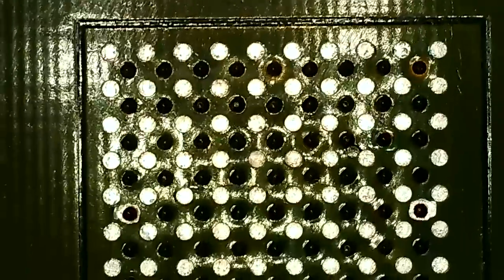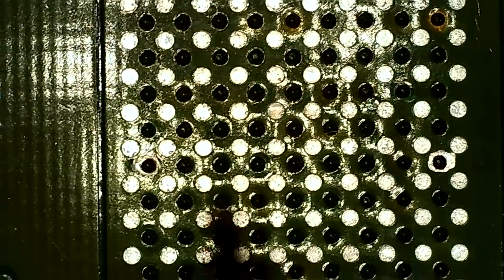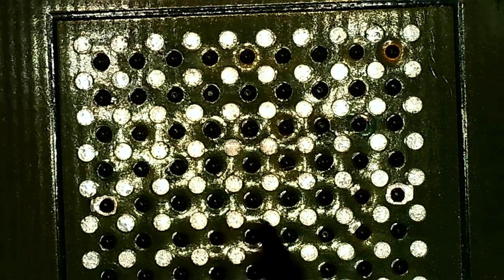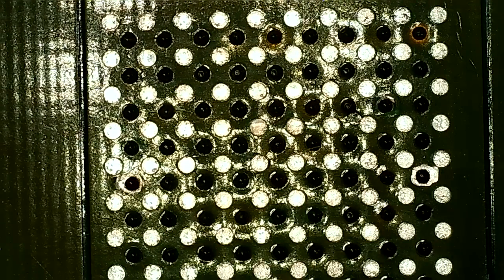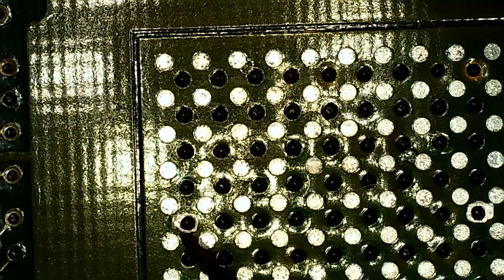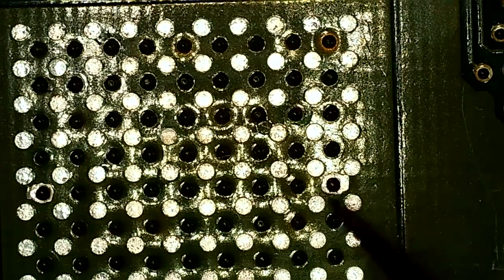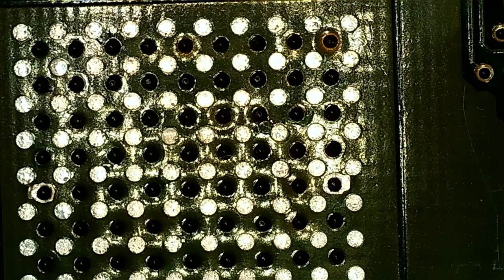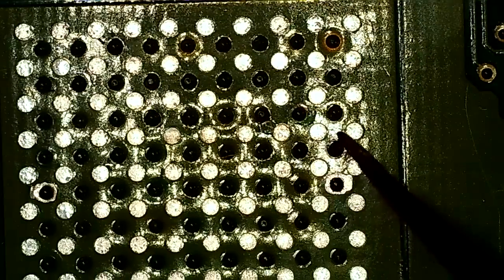Let's look at the inner pads here. So to the naked eye, we have basically vias here all over. It should all be ground in the middle, if I recall the data sheet on the Banshee, so probably the same thing here. Even later, I don't think that's the case from looking at the VSA-100. I think I have a data sheet somewhere. But anyways, seems to be conformal coating missing there. And see over here. So it's actually much more visible to the naked eye without the microscope. This looks a lot more obvious because you really don't see the smaller vias as easily.